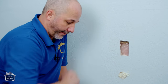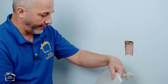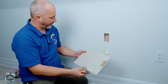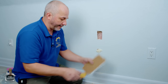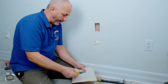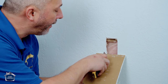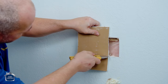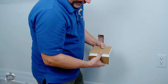While the foam is setting up we'll deal with the upper hole. We want to make a California patch - we've done that on video many times before. Basically we're going to cut a piece of drywall and then from the back side, using a sharp breakaway blade, trace out the line inside the hole left to right and top to bottom - generally the size of the hole we're filling. Then break it and peel, leaving the paper.